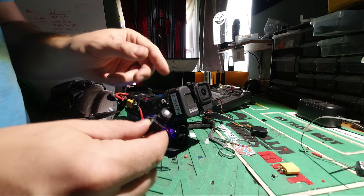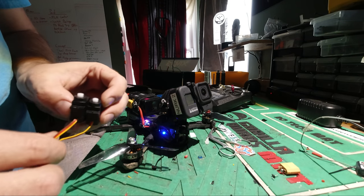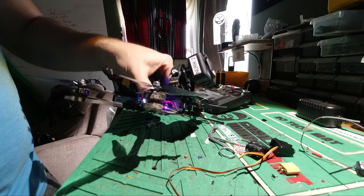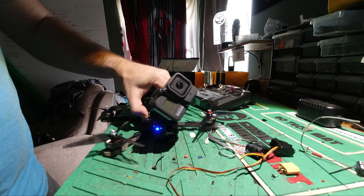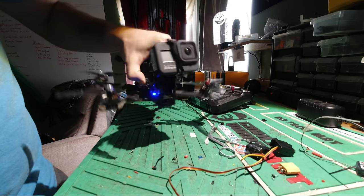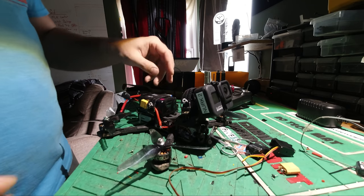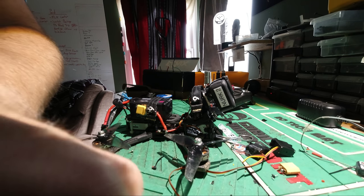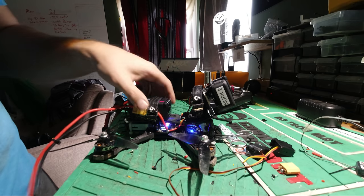These little plastic gear servos that I was originally using don't consume very much power, but apparently the 5-volt regulator that I've got in there powering the servo is getting overwhelmed. You can hear it start, and as soon as it does, the flight controller it's on resets. It's because the 5-volt is getting overwhelmed, and so it's never initializing. Crap. Okay. That voltage regulator doesn't do very well on 6S, but on 3S it works. So this cable here is 3S.